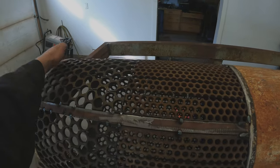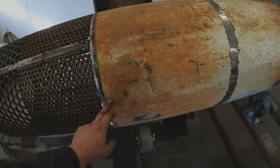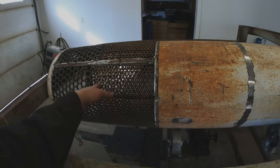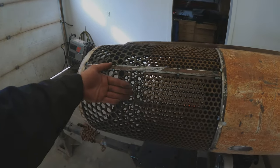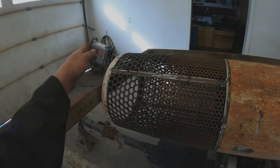One way to test is put it straight along this edge and make sure it touches in three points — all along one, two, three — and do all four corners. The easiest way to do these screen sections is to find a barrel the entire length you're looking for and then cut windows out and add your screens in from the back side. That way you know the barrel is perfectly straight.